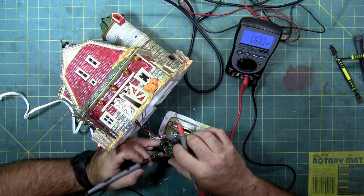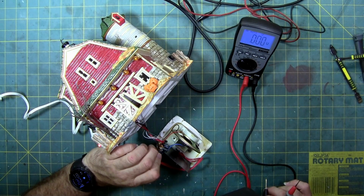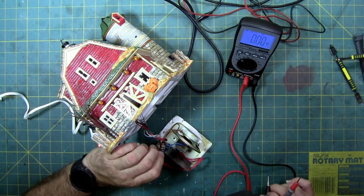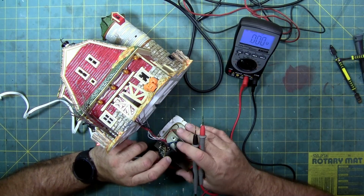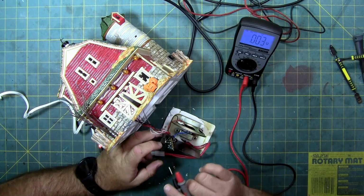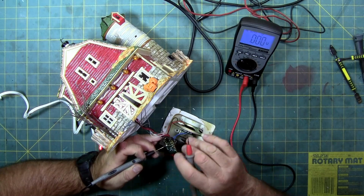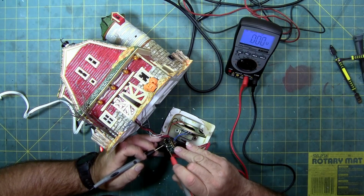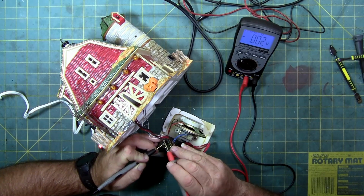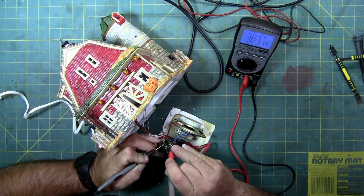So that goes to that, which is, yeah, that's the hot. I know that it said negative 5 volts because I didn't flip the meter leads in my hand. My meter will read forwards and backwards. Some meters will not. You just have to know that the negative is because you have the meter on the wrong side. It's totally fine. It won't hurt anything. If you're doing something like this when you're poking around, make sure that you don't arc contacts. That's how you can blow components. That's good.